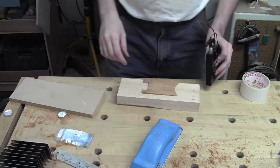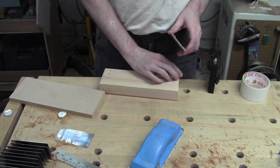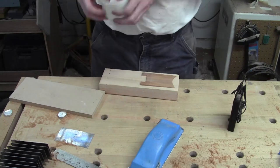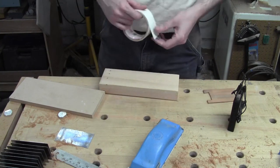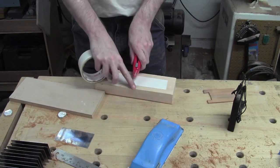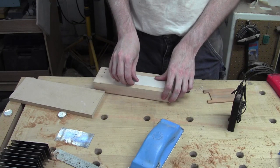Okay, now that I've got my final height established and basically my length, my patience has run out and I'm concerned about wrecking the top of the guitar body. So I'm going to go with an alternate method to get this to that taper, hopefully in a way that'll do it fairly well. I'm just going to lay down some double stick tape on this jointed piece of 2x4 scrap that I've got laying around. And I'm going to stick it down and use various methods to reach zero,